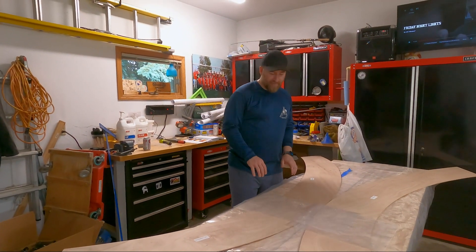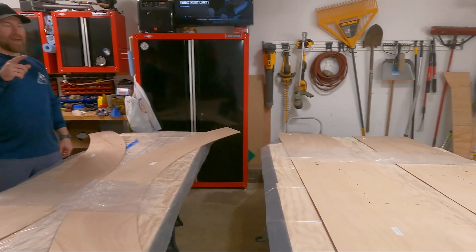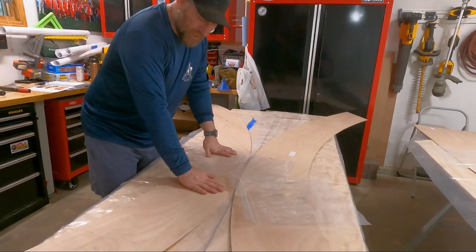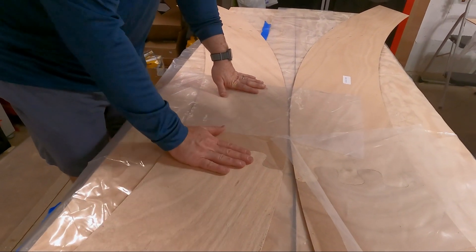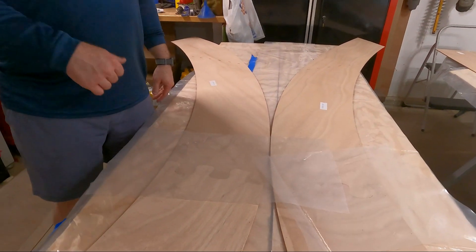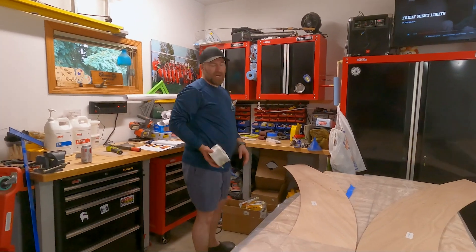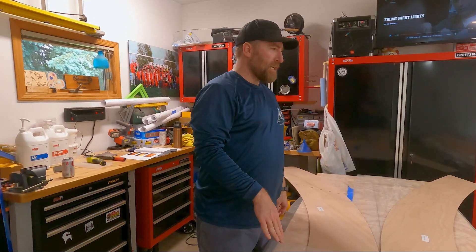What we are doing today is I've got a bunch of plastic laid out on these plywood sheets. We have a couple of the panels pulled out of the packaging and they have these puzzle joints on them. I just took some 220 sandpaper to clean up those edges. They really kind of pop together smoothly, maybe with a little bit of a rubber mallet. And what I'm going to do is mix up some epoxy — but first I need to cut to length our three-inch fiberglass tape ready to go on each one of the joints.